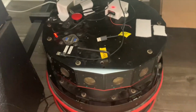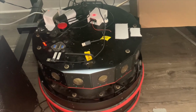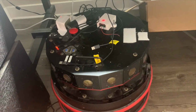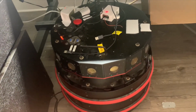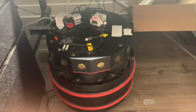So probably what happened is it was trying to rotate, but was stuck on something, or it hit something and slipped and caused it to rotate. And then the dead reckoning on the rotation was completely off, and that would have thrown off the linear too, because it essentially is just integrating the distance traveled depending on the angle. So that probably is what threw that off, but overall we kind of made it back.